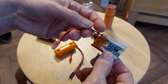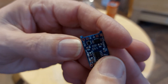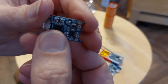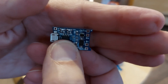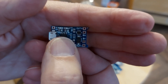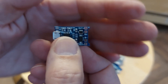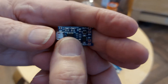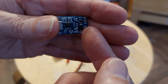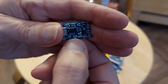On that one, I've got this extra cable coming off to the outer two tags, where it says out plus and out minus — the outside tags. Those are the ones that would go to whatever you're actually trying to power from your battery. Because the other chips on there actually protect the battery — so if it's over-discharged or overcharged, it actually cuts the supply. So that gives you protection on board as well.